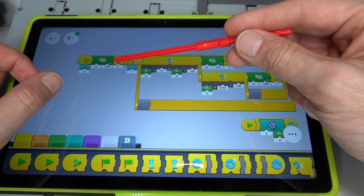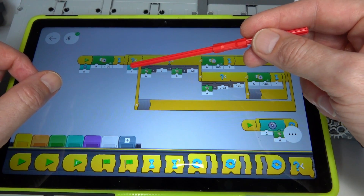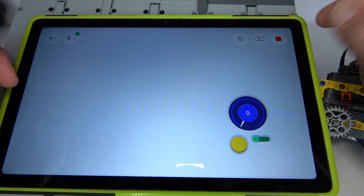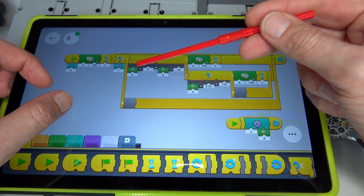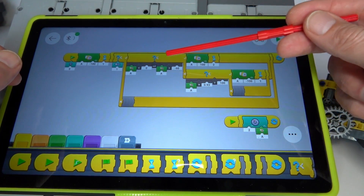There's a small delay to get things going and then I've got a test for a switch. If I toggle the switch in the interface it goes between automatic mode and non-automatic mode. In automatic mode, we first test which direction the motor is going in — that determines which gear we're currently in.